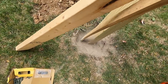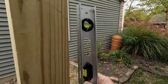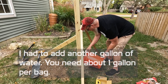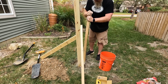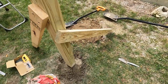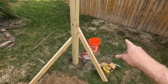That's when you know you've got it nice and settled. Two and a half bags later, I've got enough on there. Let's check our level. We're dead on there and we're level. Nice and level — ready to pour some water. Checked for level again, got my second screw in, and we should be good to go. Just gotta dig the other hole and set the other post. So fun times.